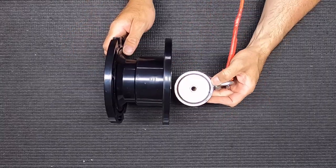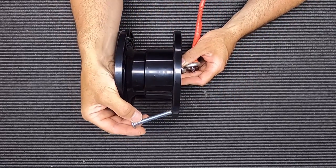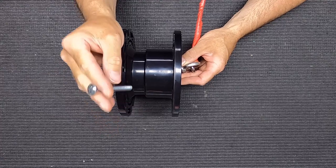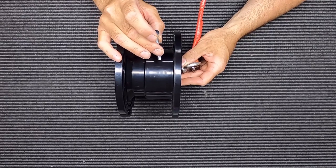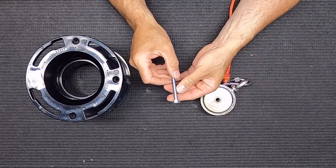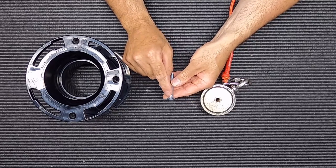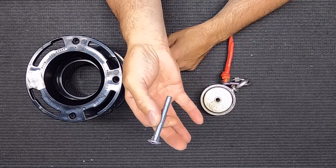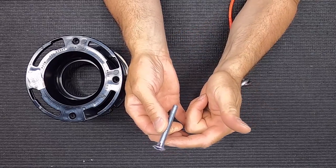I plan to store my magnet in this end, so I want to put something magnetic in there for the magnet to stick to. I'm simply going to drill a 5/16 hole — which is what this carriage bolt is — right through the hub of this toilet flange, and put a bolt on the inside to hold my magnet in place. This carriage bolt is 5/16 and has a square head underneath. Once you drill the 5/16 hole through the ABS, you drive the nut on and the square pulls through the plastic.